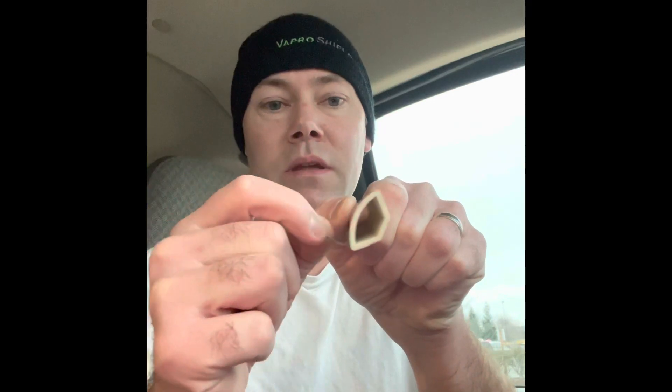If you're using an 18-gauge pin gun, these babies will bounce right off of this. So if you shoot it anything other than straight in at the bottom — you've got to go to the bottom and shoot it straight in. I kind of shot it at an angle and it just hit me right in the face, and it hit me in the eye too, and it happened about three times. I got one on my head, I got one here.